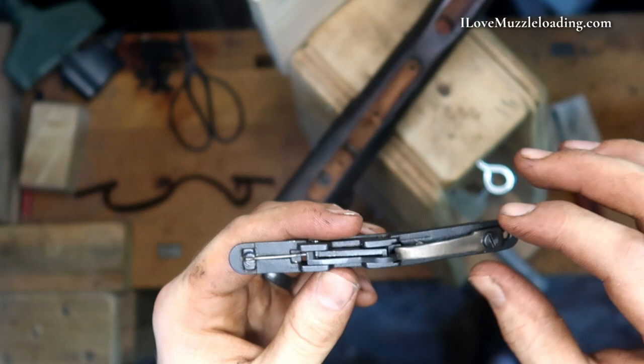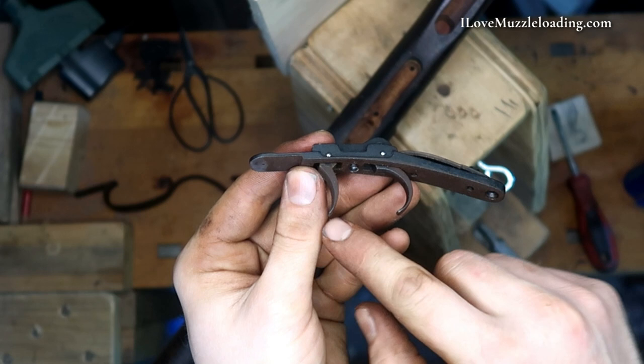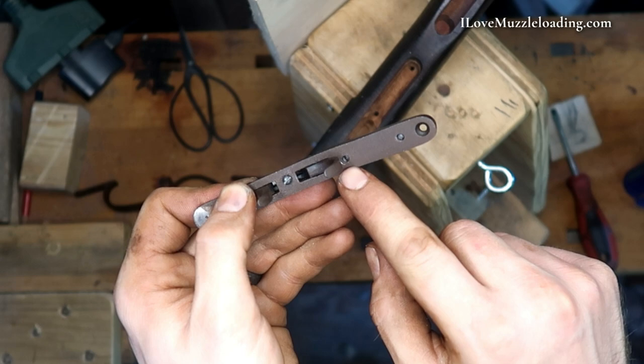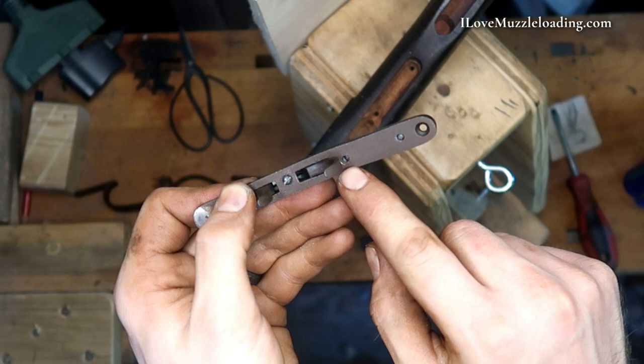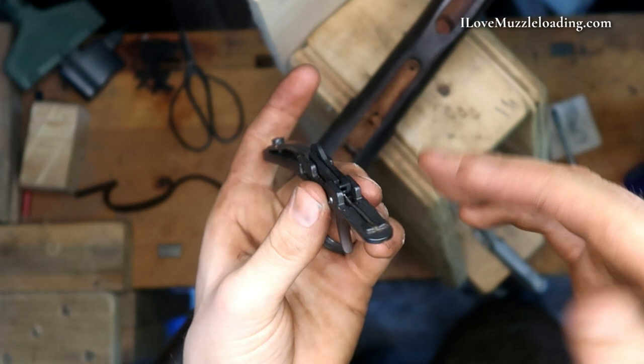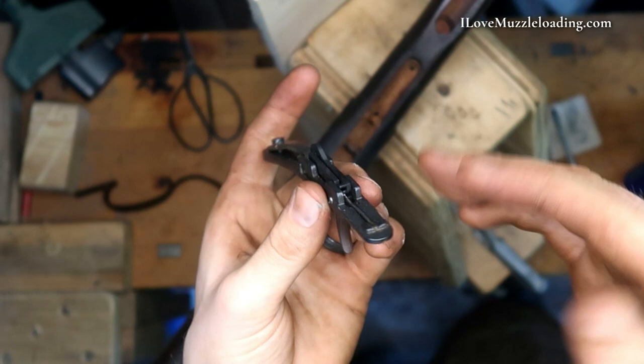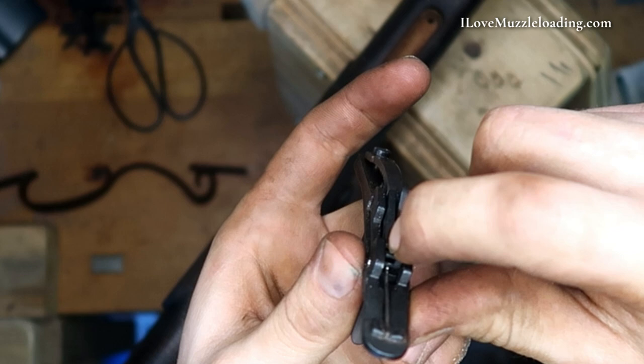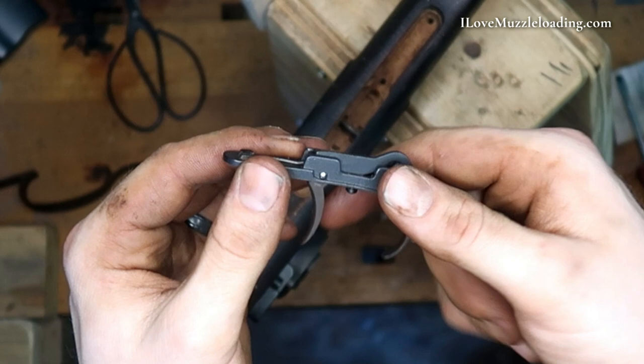After some troubleshooting, I adjusted each of these screws. This is our front adjustment screw for our front trigger — this adjusts how heavy a trigger pull you need to set off the front trigger after you've set the set trigger. This back screw adjusts this leaf spring, and this screw here adjusts how much pressure that leaf spring can have on your set trigger. Originally I had this front trigger spring up in the top notch, and I was getting really funky, mushy, non-repetitive trigger motion.